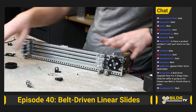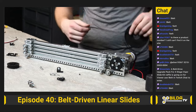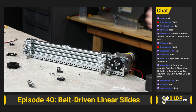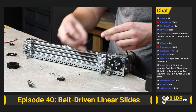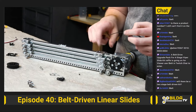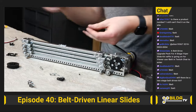Let's go through the process of rigging this up. We'll have an in-depth edited video going live early next week with lots of close-ups showing how to put this together. One of the big things we pushed for is something not only reliable but easy to adjust — it's so easy to dial in tension exactly how you want it. With cable, you have to stop, untie something, and tie a new knot. We start by making the loop and mounting the first end to our slide system. You can see the end-stop plate has threaded holes, and that bracket is essentially threaded, which makes working with this really quick.